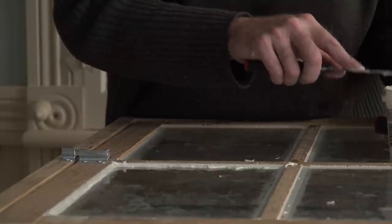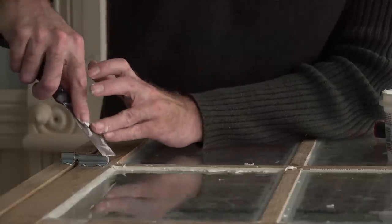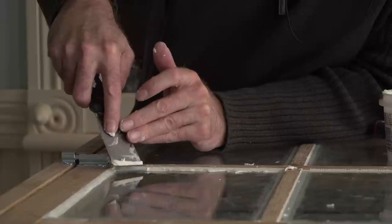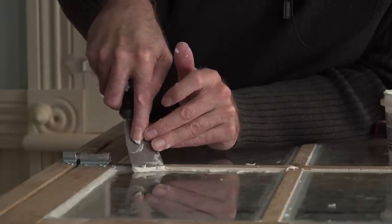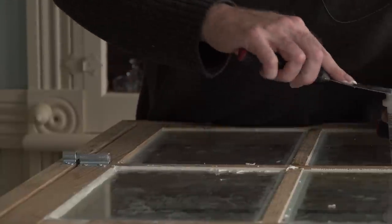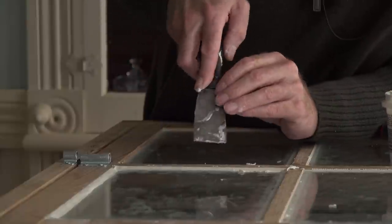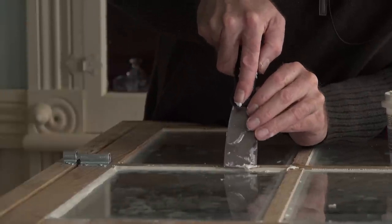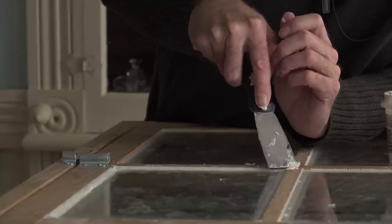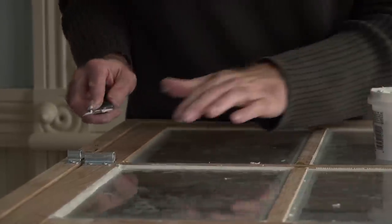Now, that looks pretty good. A few minutes ago, we couldn't do that without the linseed oil in there. It just didn't work. Okay, I'm gonna go back in here and just try very carefully to get behind this, and then I wanna peel off the excess. All that excess goes back in here and we'll reuse it again on the next spot.